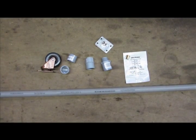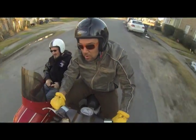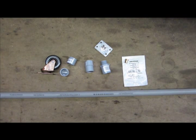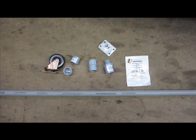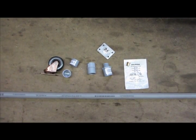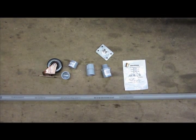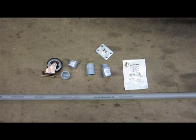Many of you have seen my 360 degree swivel rig for a GoPro that attaches to the top of a helmet. In this video I'm going to show you how I built it. I built this rig from $40 worth of parts, half of which I got from Lowe's and one of which I had made specifically. Here you'll see a 60 inch piece of half inch PVC tubing from the electrical aisle, some fittings, a furniture caster, a little brass bushing, and a funny looking aluminum plate. All of this will go together to make a really cool 360 degree spinning rig.